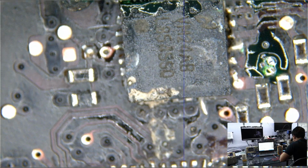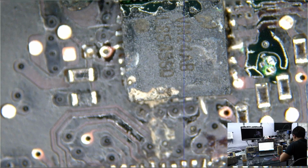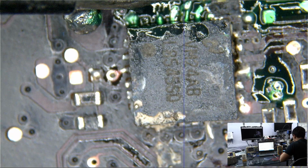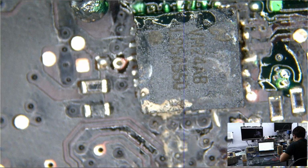See this wire that's coming along right over here? See this wire that's coming right out like this? You see that pad? That's ground. See that? That's amplifier output. That's up to 50 volts, and I am this close to ground. So you can bet that I conformal coated heavily before I put that wire there. So, let's get another view.